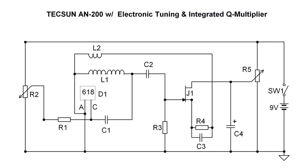If you follow my channel, you'll recognize this particular circuit on the front end. Again, taking advantage of the NTE 618 varactor diode — that being our electronic capacitor — and that's coupled or tied back into L1, that being the fixed loop, with the inductor in parallel to reduce the inductance itself.